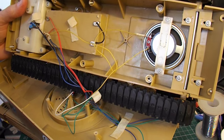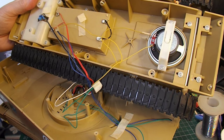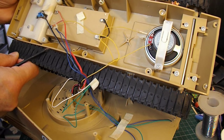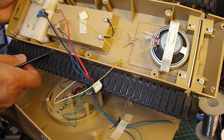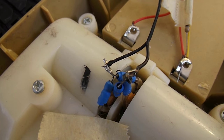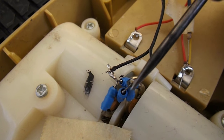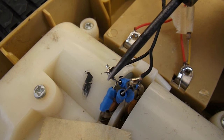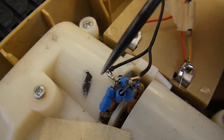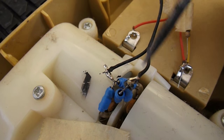Plenty of room inside. These are the two motors, so with a bit of luck we'll be able to intercept them and make them drive in opposite directions. Certainly the tracks can move in opposite directions. Just a quick close-up of the connections to the motors — at the moment they're common together, so we've got a single feed driving both motors at the same time. So if I just desolder them here, I should be able to put separate feeds to each motor.